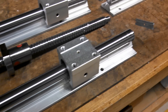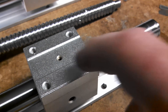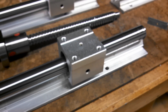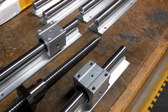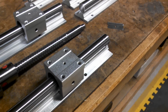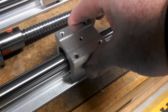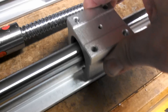Here's the other part that you've got to know. There are two adjustment screws — this hole here and this hole top center — and you can tighten them up or loosen them up. It takes very little adjustment to get them perfect. Of these two, this is my Z axis. The one on the left slid on and was perfect right out of the box. The one on the right had just a little bit of slop, and I took an Allen wrench and gave it ever so slight a turn and removed all the slop immediately.